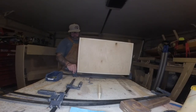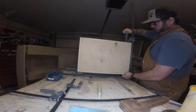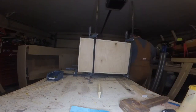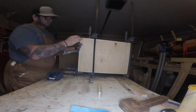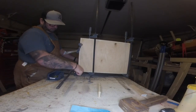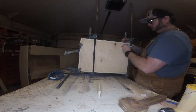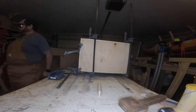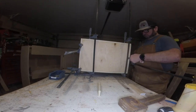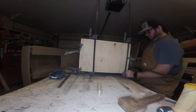I'm putting some cheap Harbor Freight clamps underneath — they have a flat edge on one side that holds the piece up and gives you room to get clamps underneath. One side was sticking out just a touch, so I grabbed a couple clamps and tightened them down gently to pull that edge right in. Less sanding later, better fit. Everything you do now is going to have an outcome on your final product. Clean a little bit of glue off so there's less sanding later.